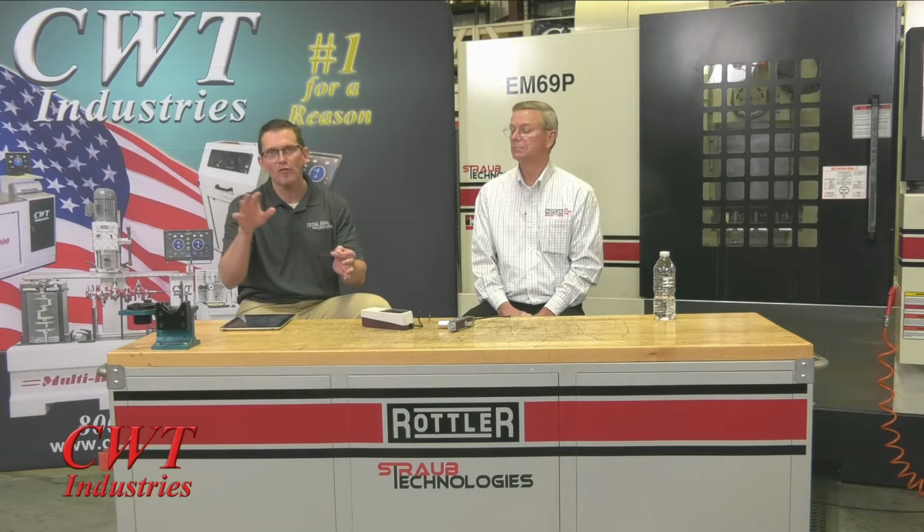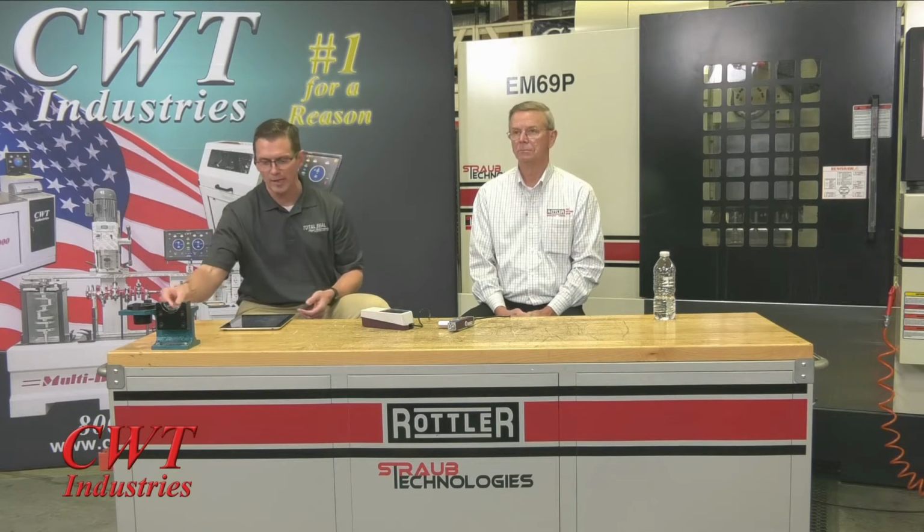So when you have these gas ports in the ring, there's some pretty cool advantages, which that's a whole other topic, whole other video for that. But to answer the question directly, no. Because this ring seals so much better because of the gas ports, you don't have to change the surface finish values in order to use a ring like this.